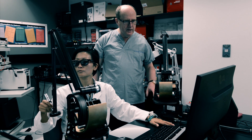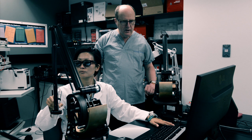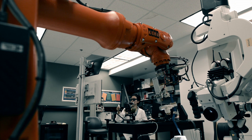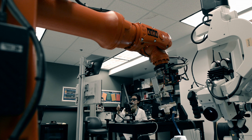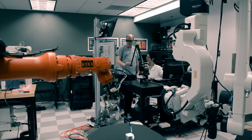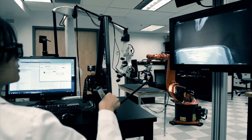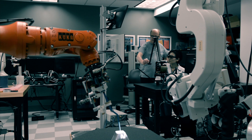That would be a wonderful tool during the performance of surgery in avoiding surgical mishaps. The slave robot, a KUKA KR6, holds a custom tool coupled with a 6 degree of freedom force torque sensor. Force information from tooltip interactions with the synthetic membrane is sent to the teleoperator via a Phantom Premium 3.0 haptic interface, whose velocity is transmitted back to the slave.